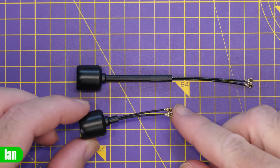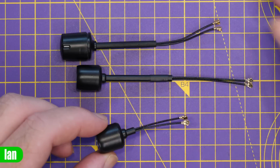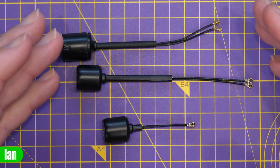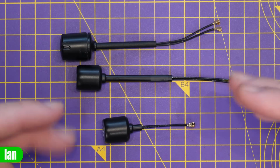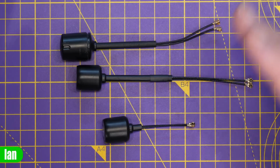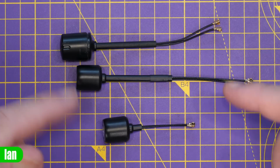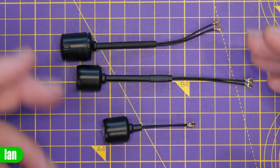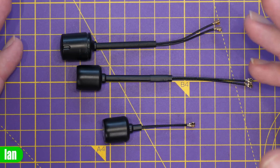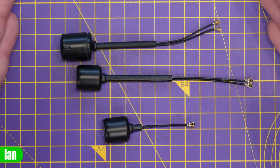They're available in different sizes, and again, just like the original DJI antenna, they have dual inputs, which are both dual band, they're linear polarized, and they're a great option as a direct replacement for the O3 antenna should you damage it, or you're looking to try something to see if it improves the performance. Overall, I have tested these a little bit and they're not dramatically better, but they're certainly not worse. What I would say is they offer very comparable performance to the original DJI one.